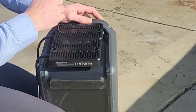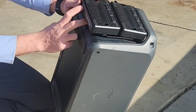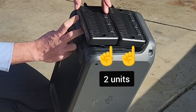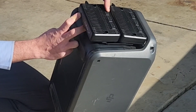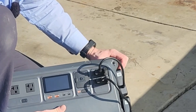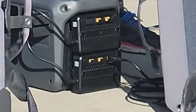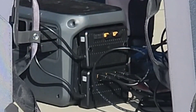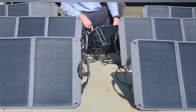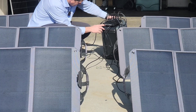Good news: if you're not planning on using solar, you don't have to pay for the solar charge controllers — it's not built into this unit. But if you are using solar, bad news, because you have to buy this separately. You can have 200 watts on each port, but it won't produce more than 400 watts per unit. So technically I have 800 watts, but the solar panels that come with it are only 100 watts each — 600 watts set up here. This is taking me like an hour to set up. We have 600 watts connected, 229 watts coming in. Not a lot of power coming in. Each port only allows up to 30 volts and 10 amps — you've got to be really careful about what solar panels you connect to this.